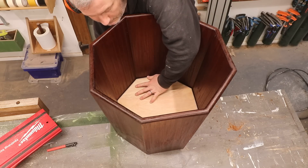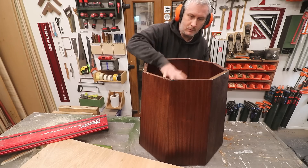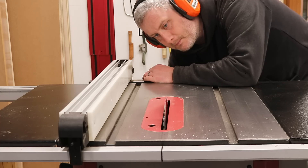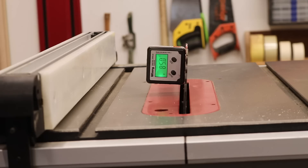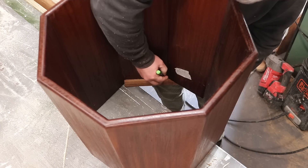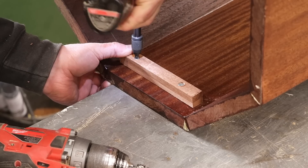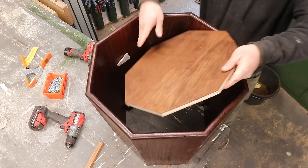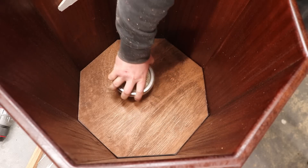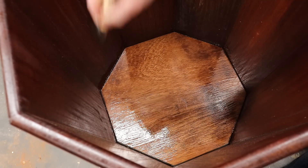I did a quick test fit and it looked fine, then I carefully rotated the basket upright so that I can mark around the bottom which is wedged in place with friction. I'm going to make some cleats to hold the bottom in place, cutting a 5 degree bevel onto these pieces too to match the taper of the basket, so that when I mount the cleat to the inside of the basket the top of the cleat will be flat to receive the bottom panel nicely. I fitted four of these cleats which should be plenty strong enough. The idea behind using ply is that it won't expand and contract so I can glue it in place onto the cleats. The solid wood basket will expand and contract slightly, but this sapele is well seasoned so I don't foresee any issues on a piece of this size.